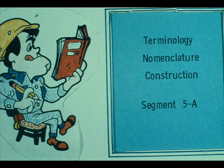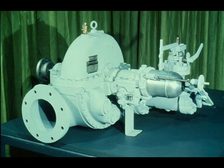Now that you have a basic understanding of the principles of operation of impulse steam turbines, we will familiarize you with the parts of a typical turbine and their nomenclature. This is the turbine we will be working with throughout the remainder of this course. It is a single-stage turbine with a mechanical shaft governor, designated the Elliott 2BYR. We will point out the primary parts, tell you the name of each part, and briefly explain its function.